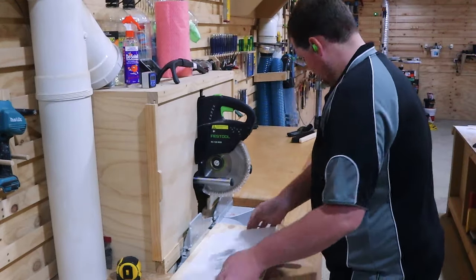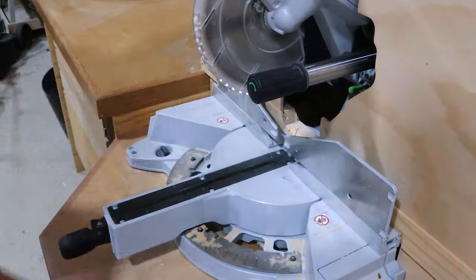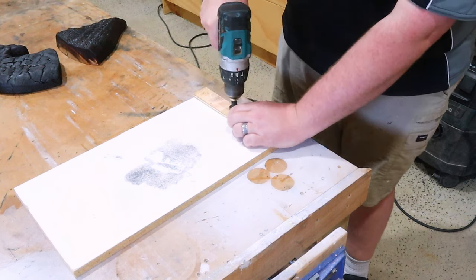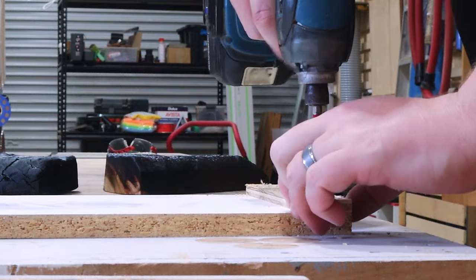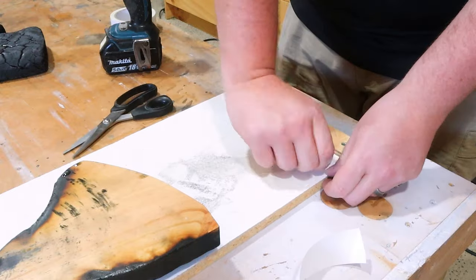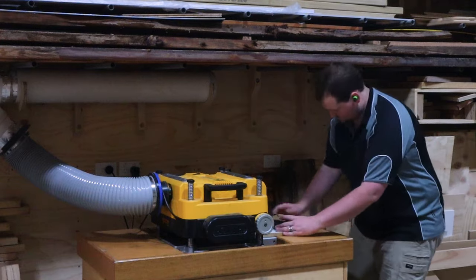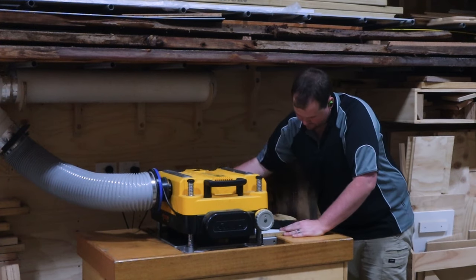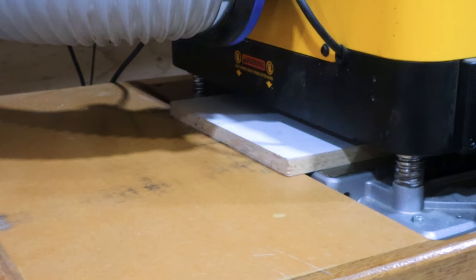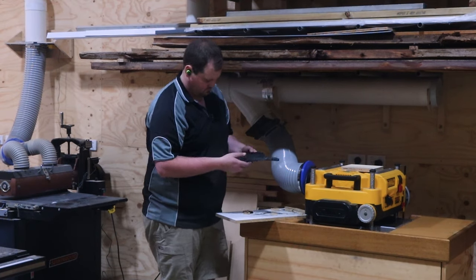You may have noticed that our timber is currently about 45mm thick — we're not making a 45mm clock, that's for sure. The reason we did this was to prevent cupping in the timber. We only need the timbers to be about 12mm thick, but had we cut it down to 12mm first, the charring would have bowed it significantly. So I'm whipping up a quick little sled here to double stick tape the timbers face down and send it through the planer to get it to final thickness and a nice flat underside so it sits in the mold securely.